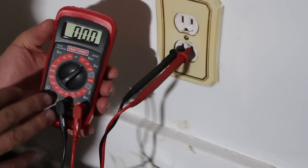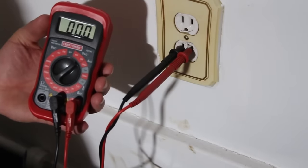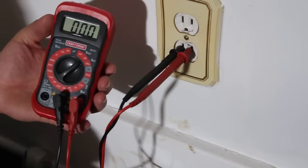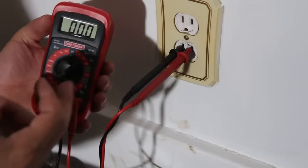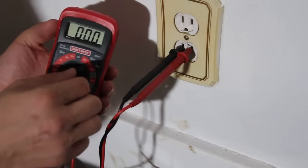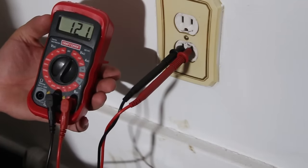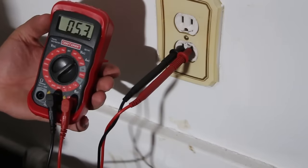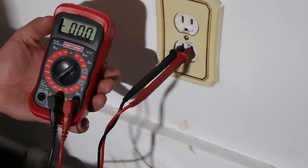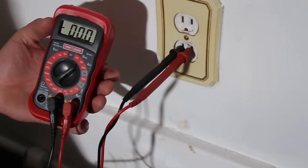And if you're not paying attention, if you looked at this and you said voltage, AC 200, I don't know that, you know, most people would say, oh, okay, it's dead. There's nothing in here. If they went to 600, then all of a sudden it's 121 volts. And to be frank, this is a problem. 200 volts. I don't think they should have used that system of metrics.